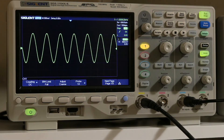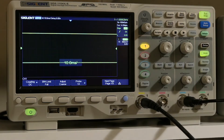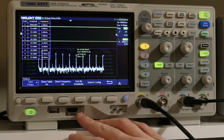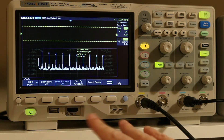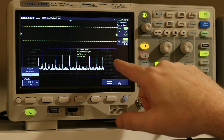The FFT functionality is something I'm very new to using, so I might fumble around a bit here. I want to put a square wave on the screen and be sampling quite a bit of it — I think I had it set to 10 milliseconds previously. I'll go ahead and AC couple that signal, then we need to go into math to bring up our FFT. It remembered my settings — even through a power cycle — which is really cool. I rehearsed this beforehand and as you can see it retained my settings.